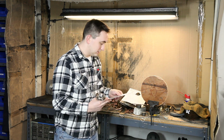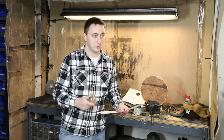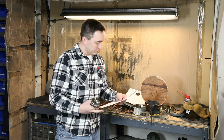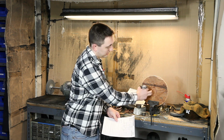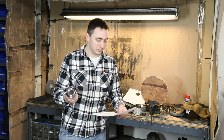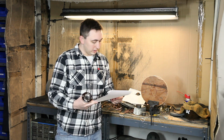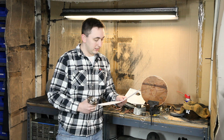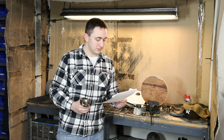Other than that, you're going to need 4 number 10 stainless steel fasteners to fit in here. We do not sell those, so they're sold separately. You'll need a file to smooth the holes and remove any burrs from the final bit here, a screwdriver to get everything installed properly, marine grade urethane based sealant, and a 1.5 inch ID fill hose, 5/8 inch ID vent hose, and stainless steel clamps to match the hose diameter.